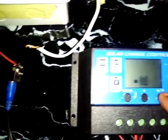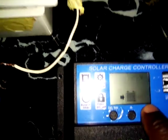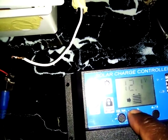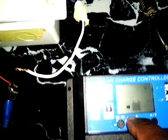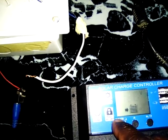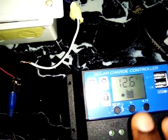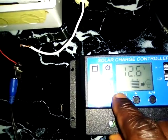If you want to increase the voltage — say you want to charge the battery beyond 12 volts — press this up button and you'll see the number going up: 12.1, 12.2, 12.3, 12.4, 12.5, 12.6. For my battery the maximum I can charge to is 12.6 volts, so I'm selecting 12.6. Then press and hold the same button again to confirm and reset. It now shows 12.6 — that is the peak voltage I want it to charge to.